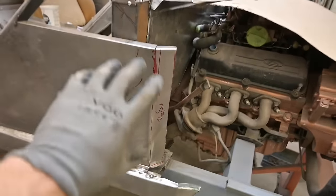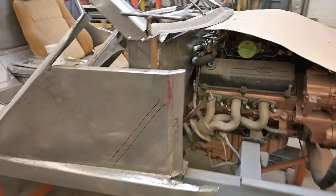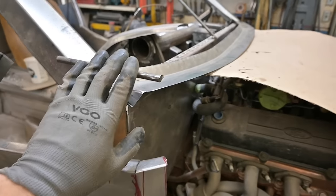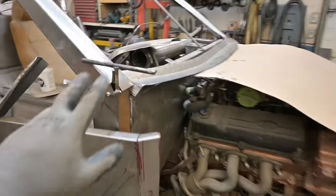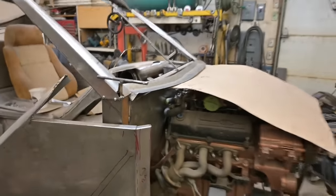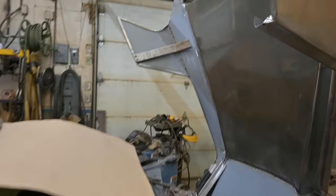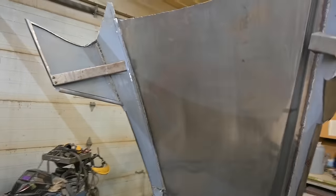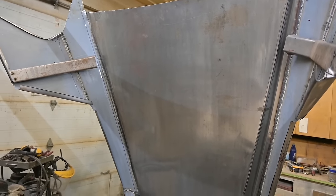Gone ahead, rearranged some of the sheet metal here. That's where the hood will be when it's closed. And this is just a guide right now. The other side's gone because we cut it away. So this is essentially a datum point that I'm going to establish where that hood is going to be when it's closed. So let's get you guys on the tripod, and hopefully with my three arms, I can get that cross member in place and supported.